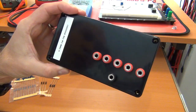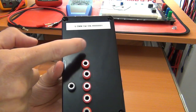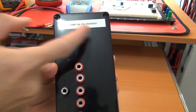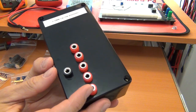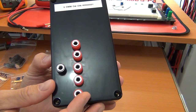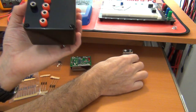Ultimately, if I do put a proper box together it's going to be bigger. The plan is: this will be a resistance check, then I could have another banana socket to do a diode test, one with an LED, one for a frequency check, one with voltage references, maybe one with a capacitor check. For power, I'd probably use 8 or 10 lithium AA 1.5V batteries — lithium batteries last far better than 9V, their storage capacity is higher, they're lightweight, and their shelf life should be better.